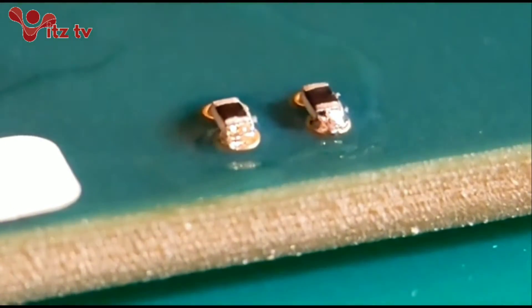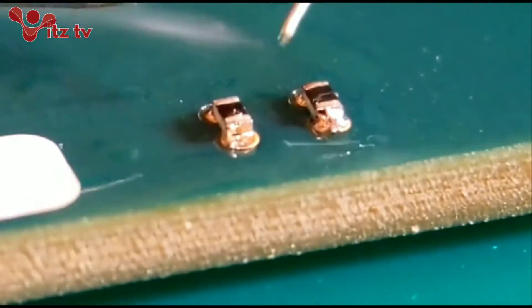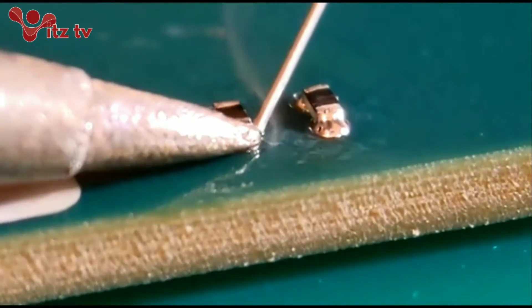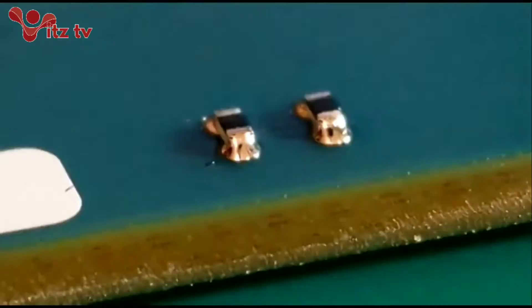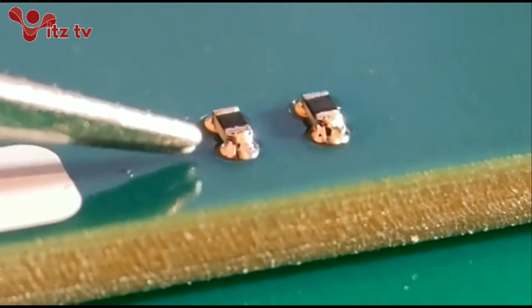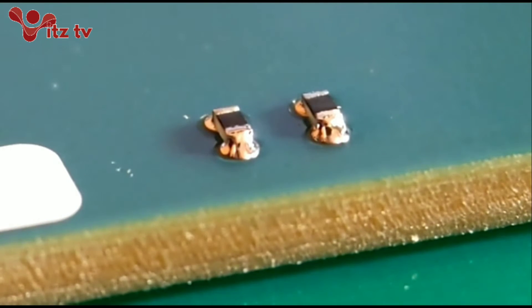As with all my two-ended components, just add a tiny amount to the other end - that's all you need. I'll show you these photos after so you get a clear view. As you see, almost double-sided just as tacks - always doing the two-ended components the same way. Just add a little bit to one end tack, do the other end properly. As you can see, a nice curved link going top to bottom. It's the same on the other end. So that's what you're looking for on the 0402s.